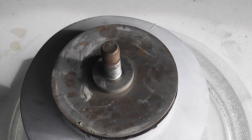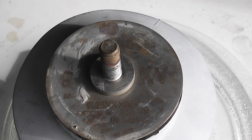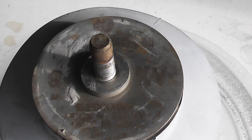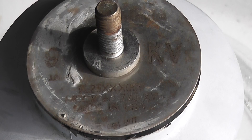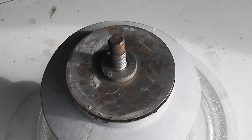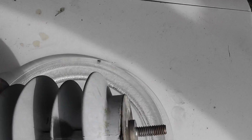I've got this lightning arrester I found in the bin. It's 9kV rated, clamping voltage 7.65kV, used on an 11kV network, which yields normally 6.35kV to ground. So this thing is vented, or operated.